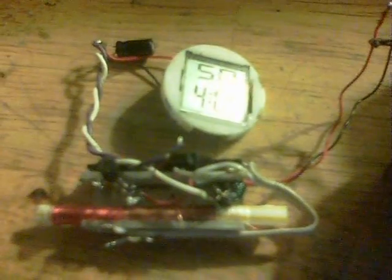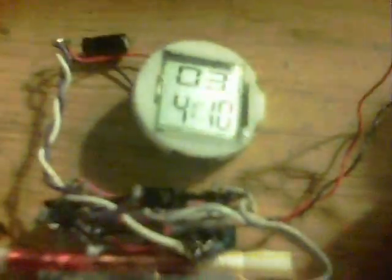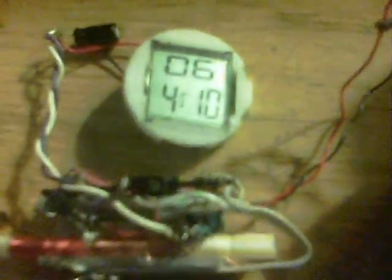By the way, for the output — to smooth out the output from one of these — you just put a 100 UF or so capacitor and that will smooth things out, so that enables running other loads.